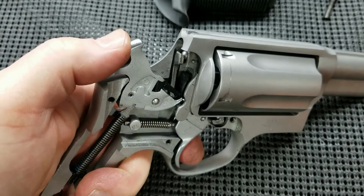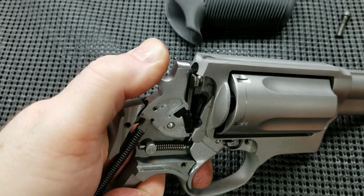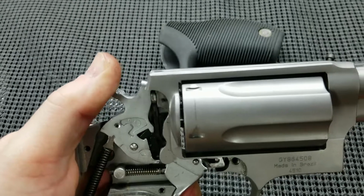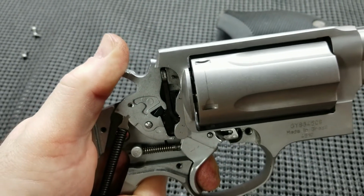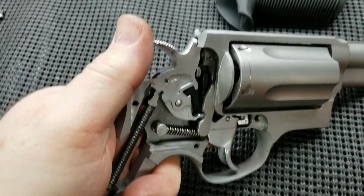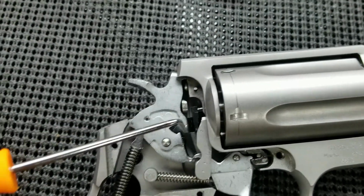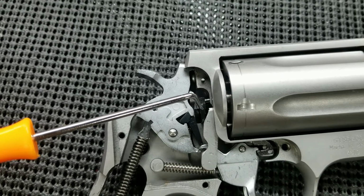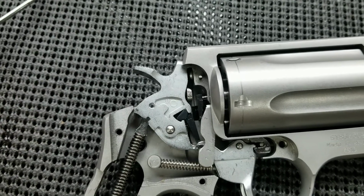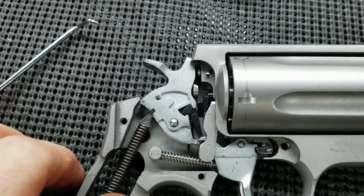Now, as you pull the trigger, the hammer drops, and you see it doesn't touch the firing pin. It touches that disconnector. Bang. See the firing pin inside there? Now watch it retract as I release the trigger. Okay, now, all of this mechanism hinges on the fact that that little catch that was cockeyed in there is in the rear position, because it doesn't want you to be able to fire the gun unless the cylinder axle is locked in place.